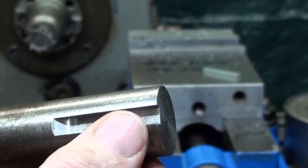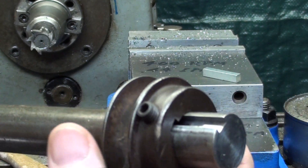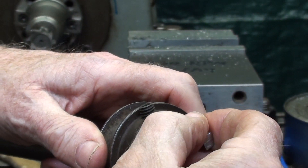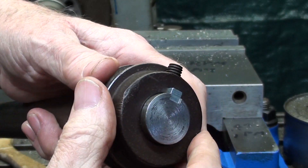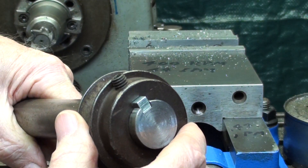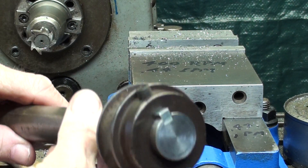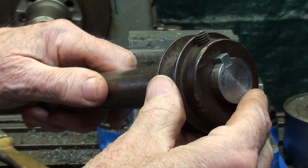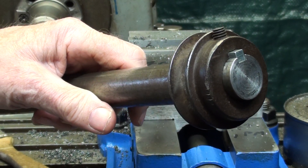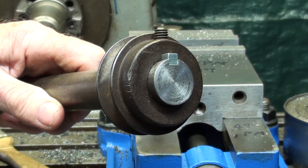That's a real clean key seat, isn't it? Better than the one I did the other day because the cutter was brand new. The pulley goes right on, and let's see if the key goes in — and it does. That concludes this video. Hope you liked it. Now in the next video, same setup — I'm not going to change anything — I'm even going to use the same cutter, and I'm going to cut in this same shaft a Woodruff key. Not a whole lot different other than it's a plunge cut. So be sure and watch that video when available. This is Tubal Cain saying so long for now. Hope you like these videos — leave a comment if you do, and I'll see you next time.